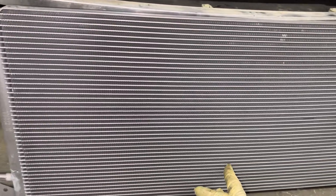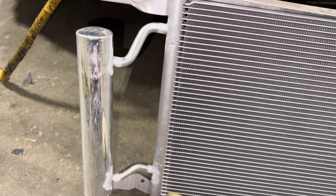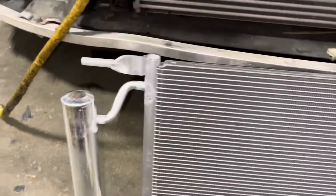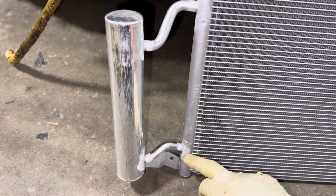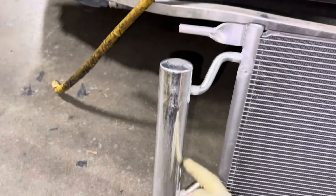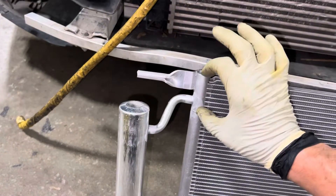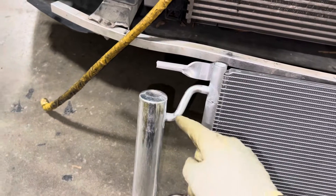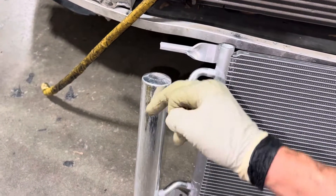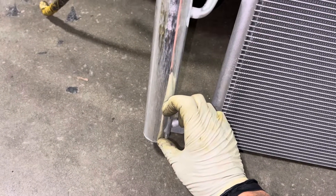The lower tubes — we have six tubes — and the vapor and a little bit of liquid, it's almost all liquid, not quite. It's condensing as it comes through. One, two, three, four, five, six, seven, eight, nine — they actually have nine tubes coming across. That fills this area up here with a bit of liquid, not quite all, and some vapor. Then it goes into the receiver dryer. This has a desiccant material in it and a dryer.